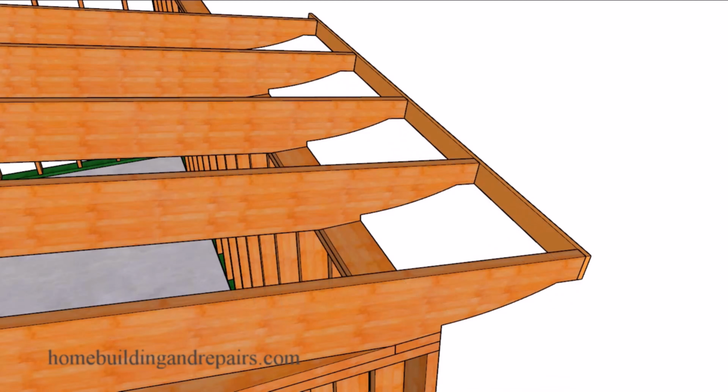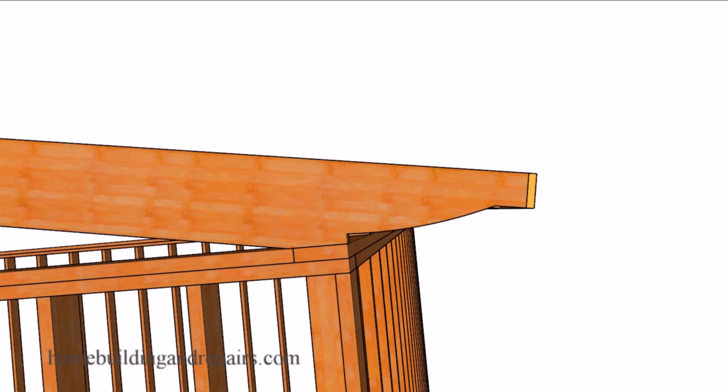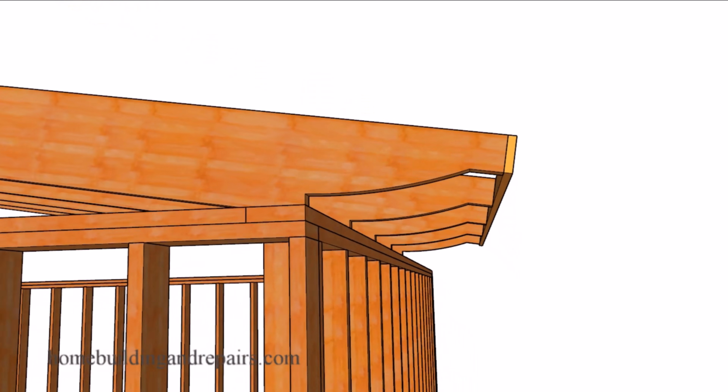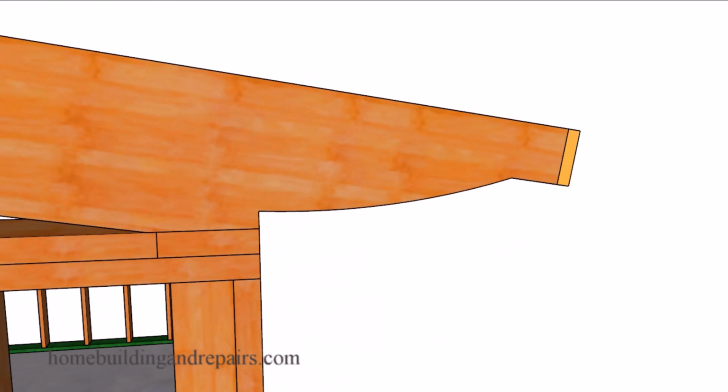And if the rafters are a little wider, you can always put a little design on the end of the rafter tails. And of course, this design here would create a stronger roof overhang than it would if you ripped this down to 3.5 inches here. However, this wouldn't be something that's going to save a home builder money, because this could be labor intensive here.